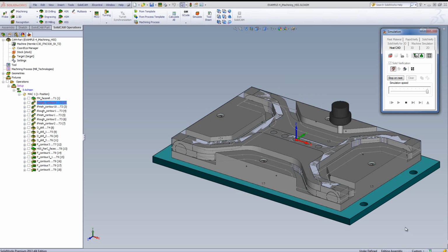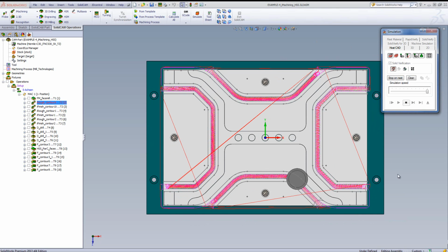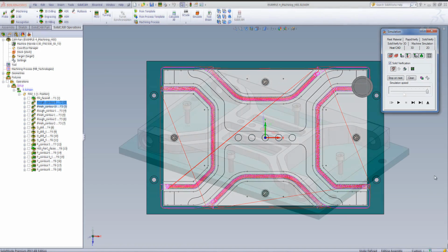Now, the iMachining actually makes it working very efficiently inside those slots. If I were to look at it in the top view and show the actual tool path itself, you can see that it's taking the trochoidal path around through the slots itself, and also cleaning off the corners over here using the trochoidal tool path for those corners.